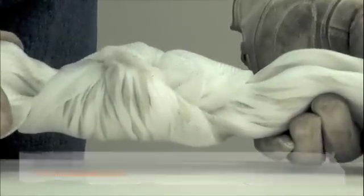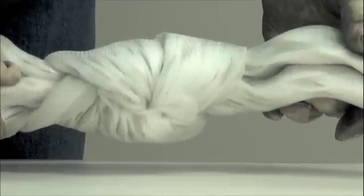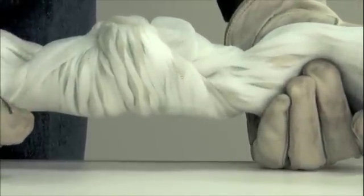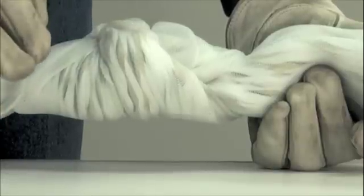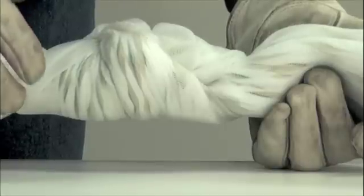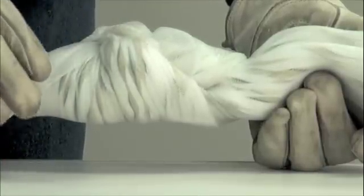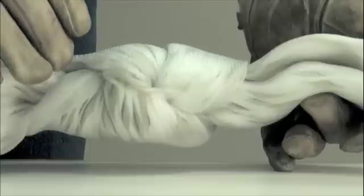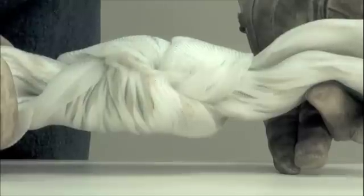Once in a while, a sling is used on a job site and ends up in a hard knot that is pulled under direct tension. You'll see by this knot that throughout the entire sling body there is substantial fusing and heat damage inside the knot. We're not able to untie it — it is permanently in place. If someone attempts to take it apart with tools, they'll likely break the cover and the core yarns. The heat generated in that knot can cause substantial loss of strength. This fusing and damage in this configuration is an immediate rejection from service.